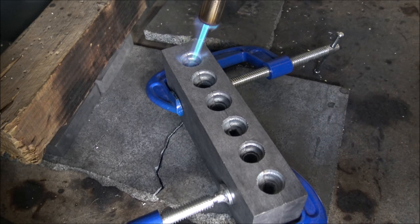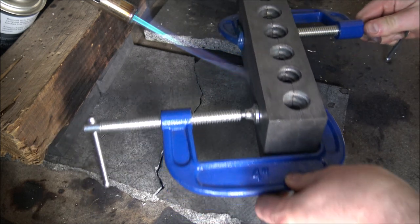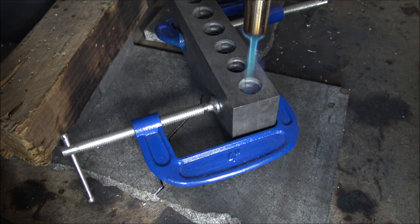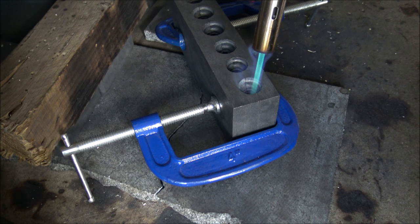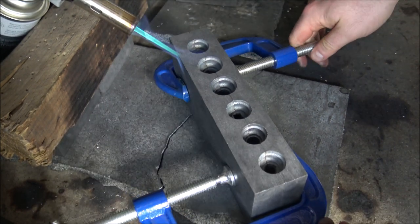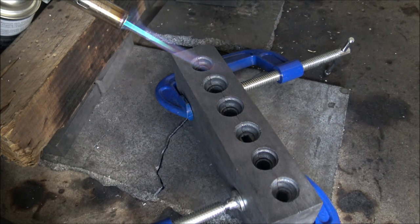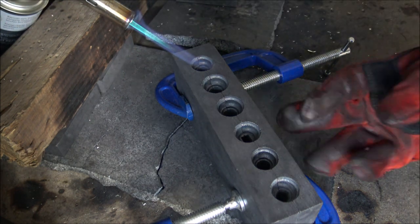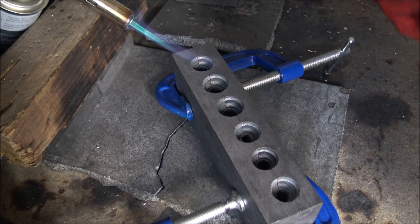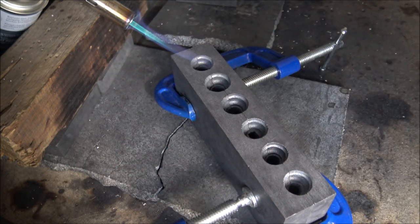Just using a little butane blowtorch like this seems to work well. We're pouring both ends of this mould, which is always a little bit awkward. I like to have the flame on the opening to aid the entire process, although I want to turn the flame down a little bit — I don't want the force to blow the molten silver into funky patterns. I'd rather it be as smooth as possible, since we're going to be sanding down these bases to a nice flat surface.